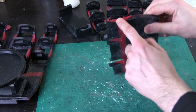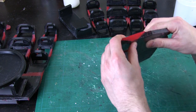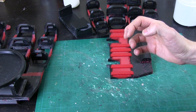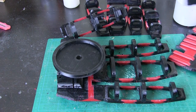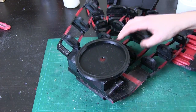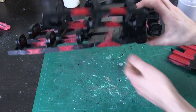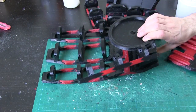I've printed the hand backs and we can see the flexible red Ninjaflex region and the two black ABS regions. It's quite bendy but less so than the fingers, which is correct — this is the joint at the base of the fingers and I don't want the hand to fold flat, just a little flex there. I've put this hand together — this is the left hand — with a block that holds the thumb and the repulsor placeholder. The skins will come around this to reveal a much smaller repulsor. Let's offer it up next to the suit to check the size.